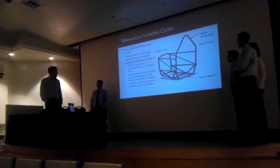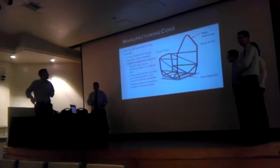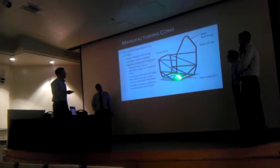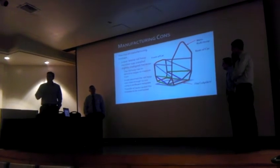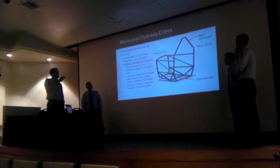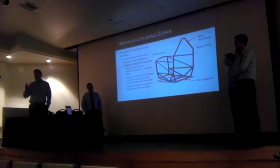Thanks, Jeff. Okay, now the fun part, when design hits reality. When manufacturing began, everything was going smoothly, starting from the front of the car along towards the back of the car, until a certain mishap, and that was the guy right here. That's the main roll hoop of the car, and when this lower lateral member was installed into it, it was installed slightly unparallel with the bottom plane of the car. That consequently caused the main roll hoop to be connected to the midsection of the car slightly tilted. And that consequently caused the rear section to be slightly off position as well.